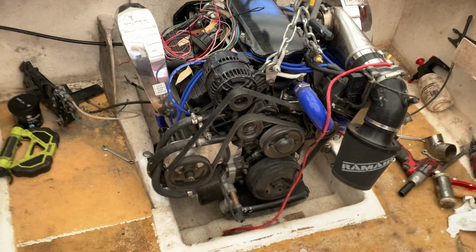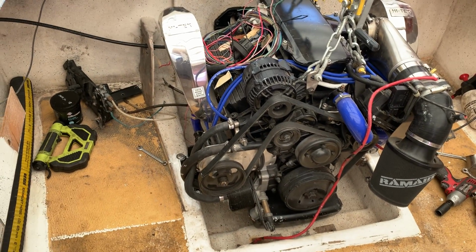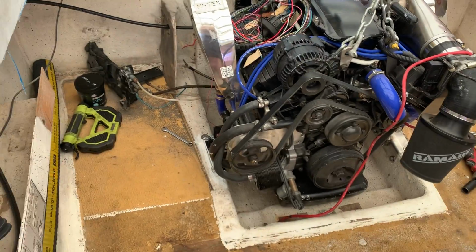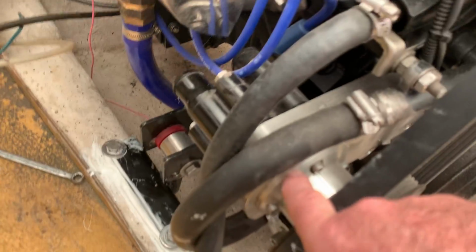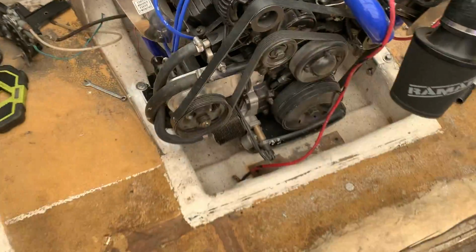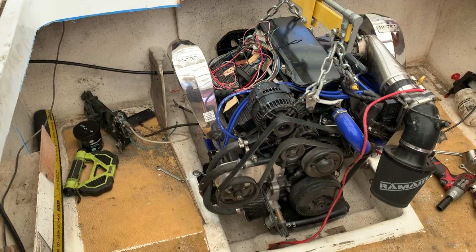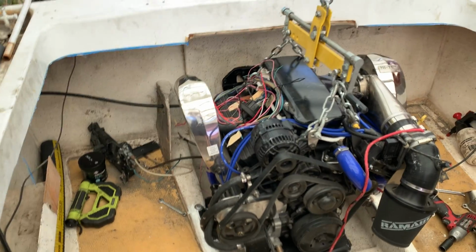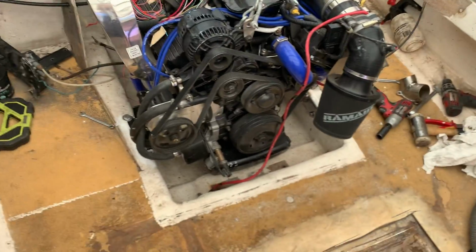Anyway, I'm not gonna whinge about that. I'll put a steel sleeve, like a top hat sleeve, that the bearing sits in, that bolts in with the front cover. When the main bearing went in, which is a double row roller, it picked up and dug a big hole in the bore, and now it's not straight anymore. Now it doesn't turn straight anymore.